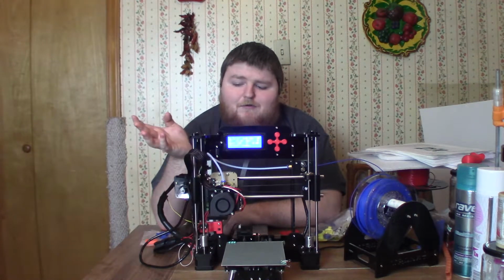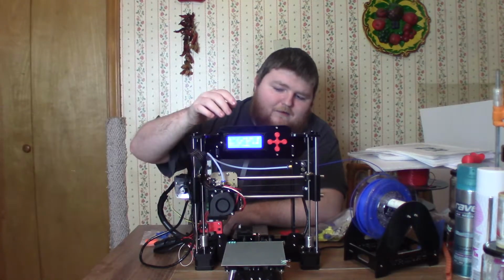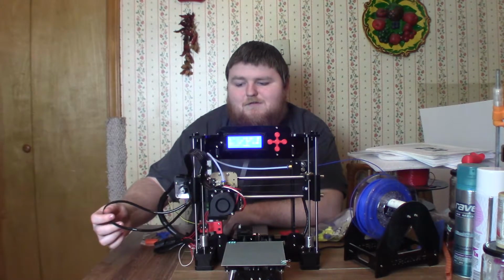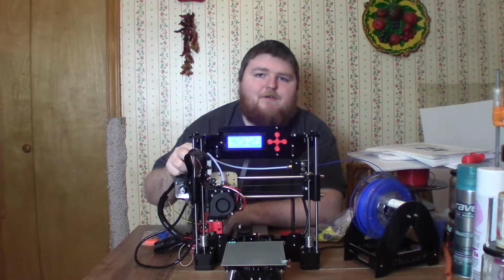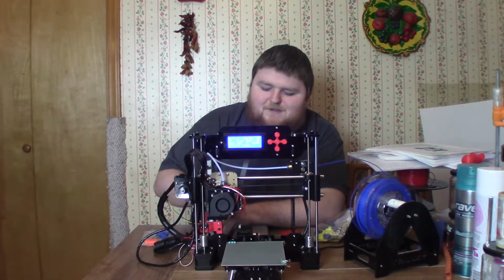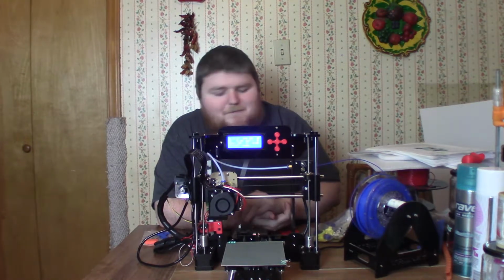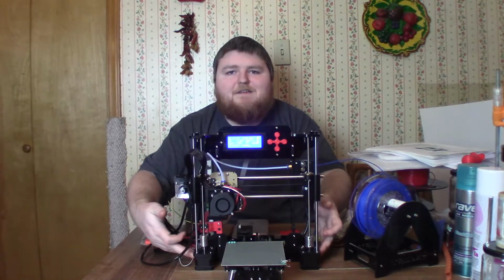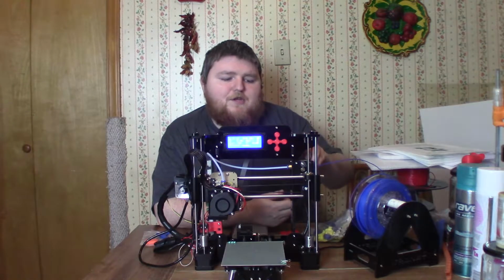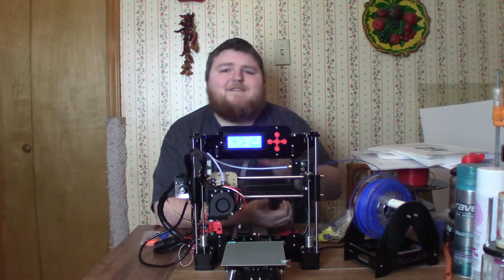And they tell you, oh, you're running a wire from the extruder, but they call it C instead of E. Well, you already know where the motor is, you know what wire's coming off of it. You can, for the most part, because it's got this label, figure out, oh, this goes into X, and this goes to E, and this goes to Y, and these two go to Z. And as long as you know the basics, which for the most part it'll tell you these two are Z. For the extruder, I'm pretty certain it does say C in the manual that we have, but you see this and you kind of go, oh, I know what that is, I've got one of those. It's not like they all look exactly the same.